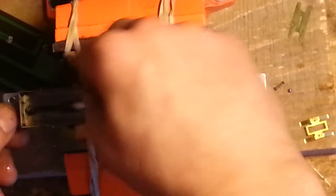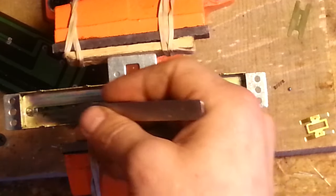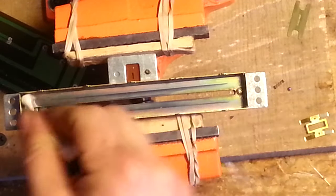We just want to get any grime or grease that's in here, because the grease initially picks up all that dirt and stuff that comes inside, gets all over the fingers of your fader, and then it starts to read weird — it starts to affect the platter in strange ways. So it's good to get this as clean as you can. Once in a while I open these up — especially from DJs working in clubs — the last one I opened had vodka and Red Bull spilled inside the pitch fader, with a solid layer of sugary goo on it, so I had to scrub it with a toothbrush and rubbing alcohol.